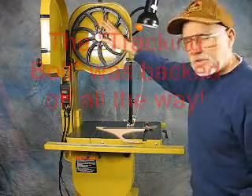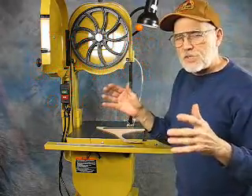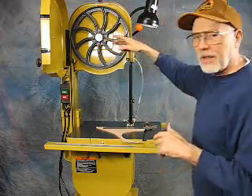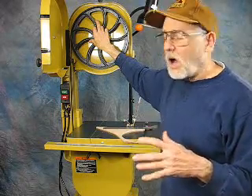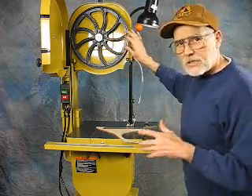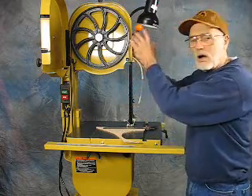When I measured it, I found that with all the tension off, the top half of the wheel was still a little bit back. I don't know if this was to help induce some twist when the blade is putting all that tension on it, so that everything accesses around and is in line again — because you have to remember that this upper bearing guide is floating in that back plate and just slides up and down those tracks in the back. I didn't check it after I put the riser block in. But when I put in the new 105-inch blade and got everything guided up and adjusted, it tracked perfect.